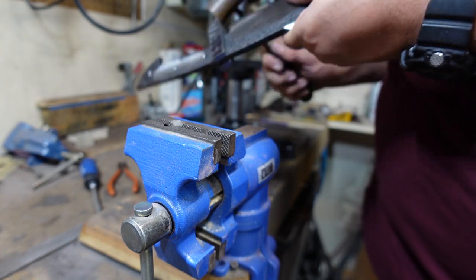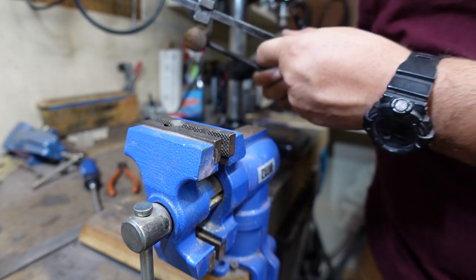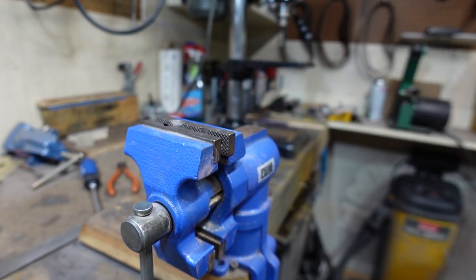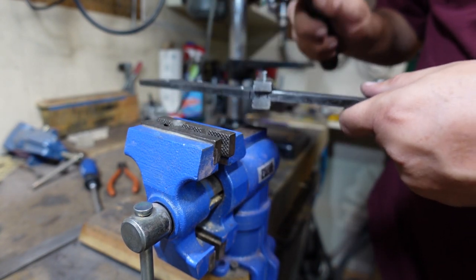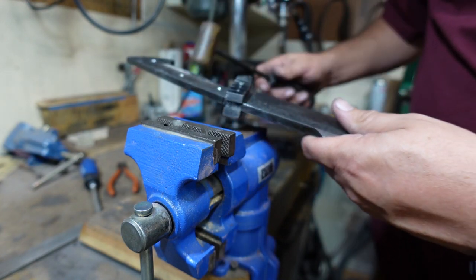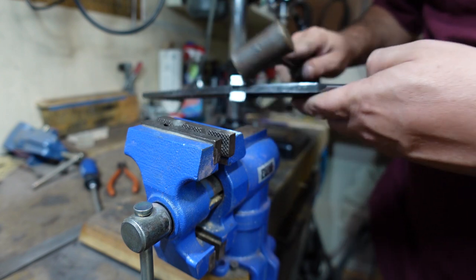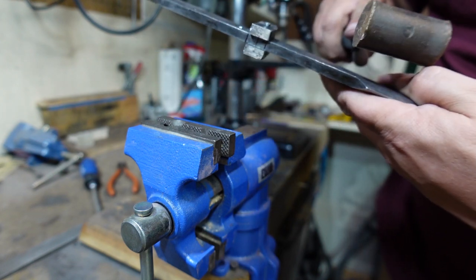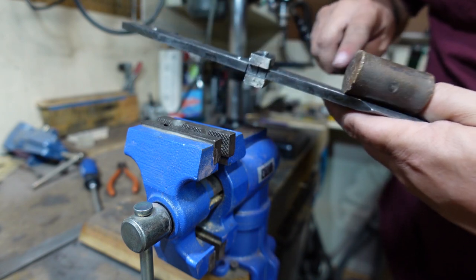Right now I'm using a brass hammer. The nice thing about this hammer is that all the times I needed to put the guard on and take the guard off, I could use the brass hammer and it was not hurting the knife itself — brass is softer than the knife and doesn't actually hurt it even when sliding it up or down the side. If you don't have a brass hammer I highly suggest you get one. There was a lot of putting the guard on, taking it off, and a whole bunch of filing that went into this.